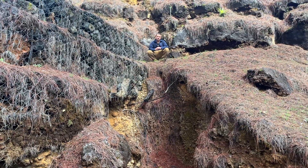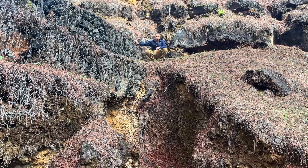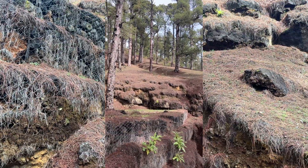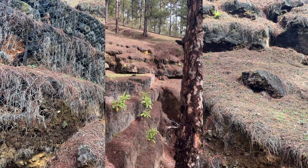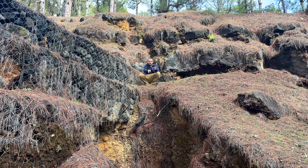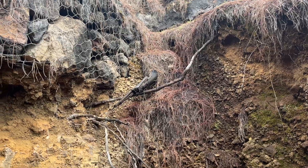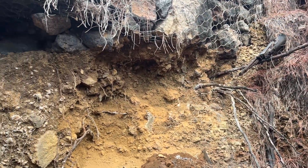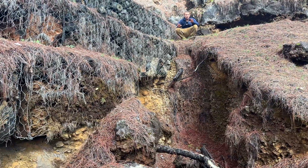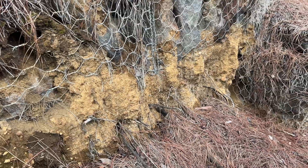Placement of these features is also critical, and here we can see a massive flaw. This structure took quite a bit of time, energy, and money to build, and unfortunately just above me there is another little valley and another erosion cut. So what happens when it rains? Water goes into this cut, starts washing down, and comes with a lot of force - it falls down, builds a bit of a waterfall, and in this area it's washing away the base of our features. The base of a gabion or dam wall we always want to protect.